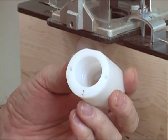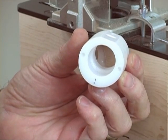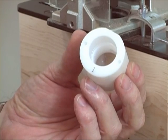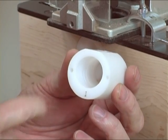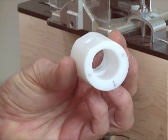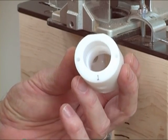A lot of people are curious about just how this wood threader works, so I'm going to give you a little demonstration. This is the one-inch insert and it has a smooth part at the entrance, which is a hole that is slightly over one inch — this is what takes the dowel when you start to thread it. Back behind that is another hole of a slightly smaller diameter that's threaded inside. If you look in there just right, you can see there are threads down in there, and those threads are what guide the dowel once it starts to cut.